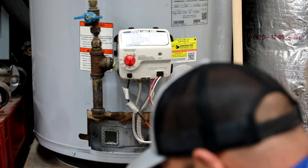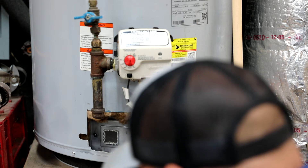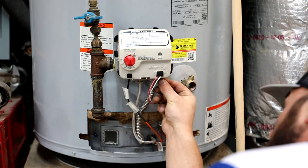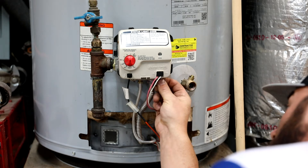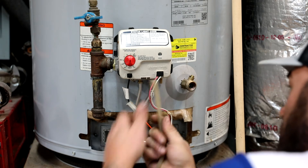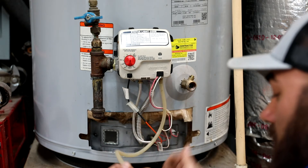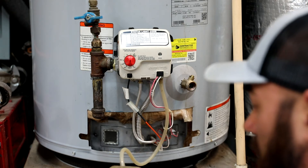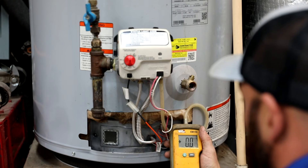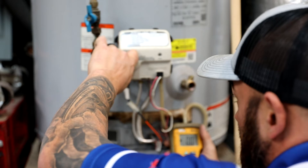You've got to check your inlet pressure before you get started. There's a little adapter — we're going to thread that up in there. It doesn't really have to be tight or anything like that, just get it hand snug. We're going to zero our meter back out, turn our gas on, and relight our pilot light.